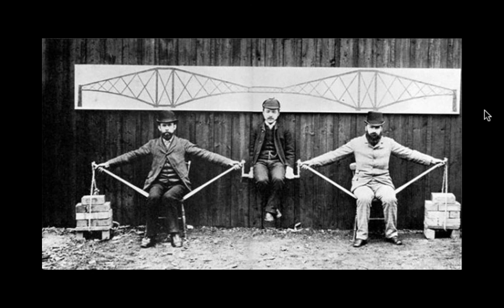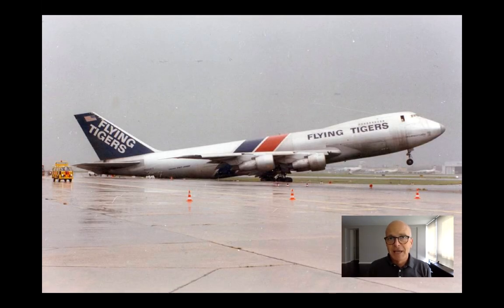Okay, so hopefully those illustrate the ways stresses interact within a building frame. We know some of this intuitively because we walk all around the world each day in our own structures, right? Our own structural systems composed of structural elements. Key takeaway is that these forces are important to identify, important to understand how they flow through a structure, but it's not just how much force there is, but also where those forces are. And if, in fact, we get it wrong, we can have structural failures like the one you see here. This poor plane is subjected to a very, very unequal overturning moment, and in fact, has rotated in a way that it has eventually found equilibrium, but probably not in the way that the pilots wanted.